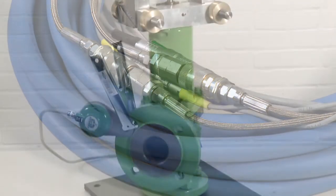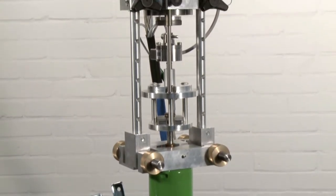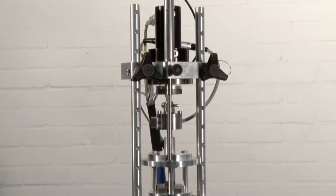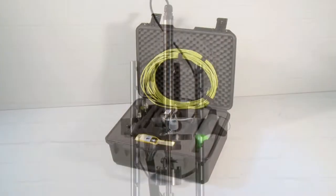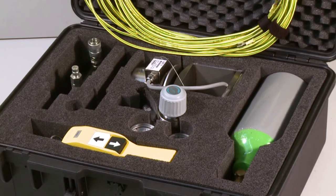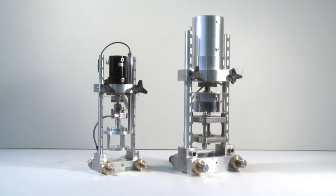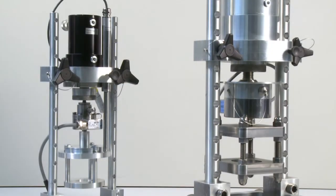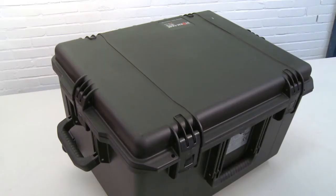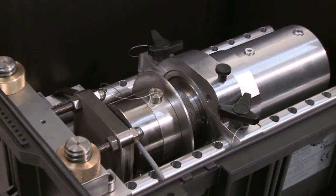The bracket is delivered with a set of three load cells, three cylinders, a lift sensor and acoustic sensor for accurately testing all sorts of spring loaded safety valve types and sizes in gas, liquid and steam service. The optional 50kN test bracket is specially designed for extremely large safety valves and for testing these with limited or even no line pressure.